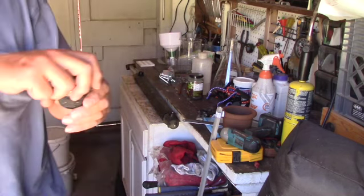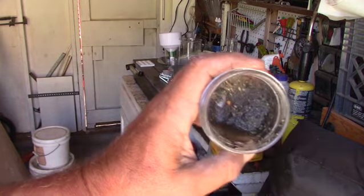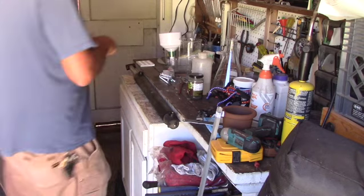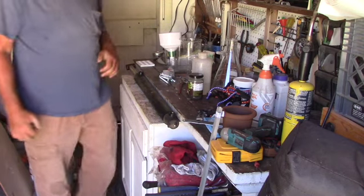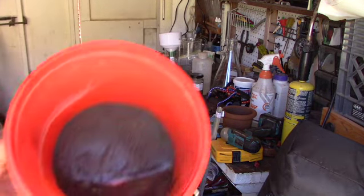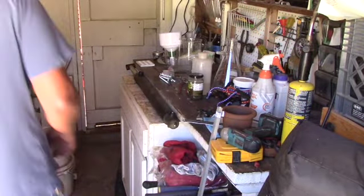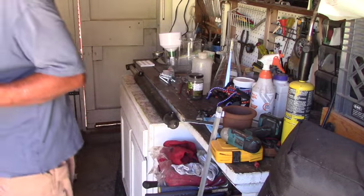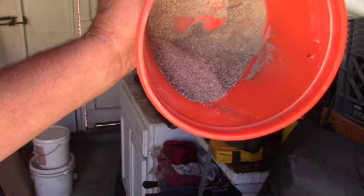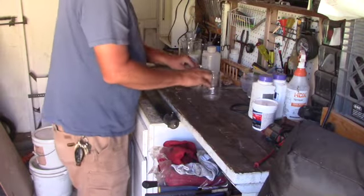But here's the irons we got out of our outlet tray from the trommel. We had a couple of magnets underneath and it picked out the iron. We'll make sure it doesn't have any gold in it. So that'll be sample one. And here's our shaker table output. And this is what we got off of the gold cube, our sluice. So we'll test all three of these samples and see what we get.